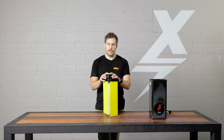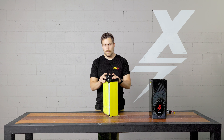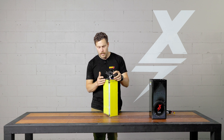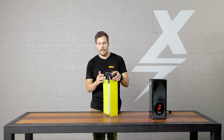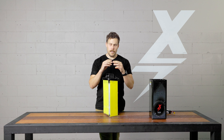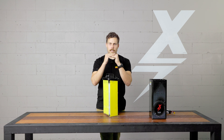When we load test these batteries in the factory at about 18 to 20 kilowatts, we only have about 4 volts of voltage sag, which is really good and they can hold that. They won't deviate as power is put onto them. Another thing we've done over time is we started with soldering the cells together — getting a really big solder gun, laying a big bead on there, with the tabs overlapping top and bottom and soldering them on.